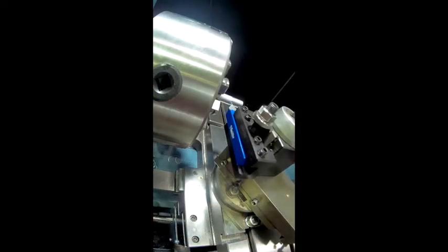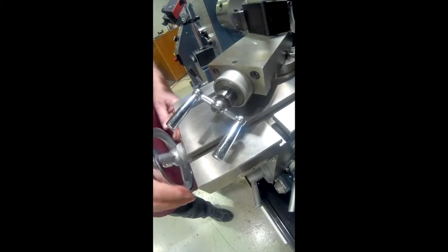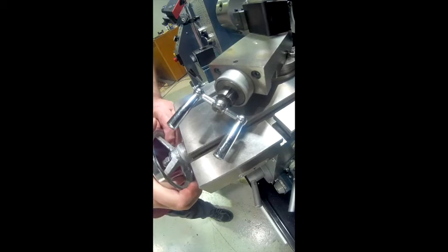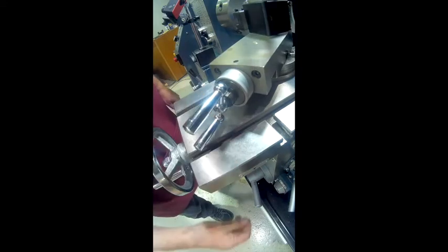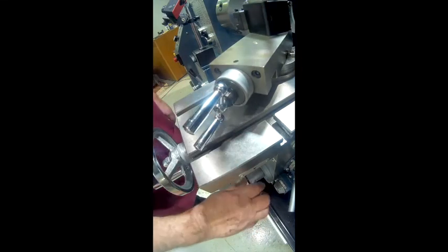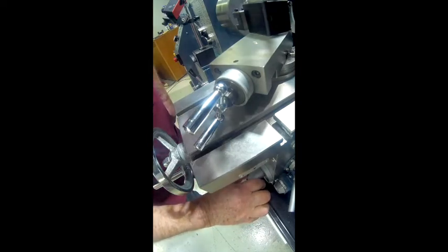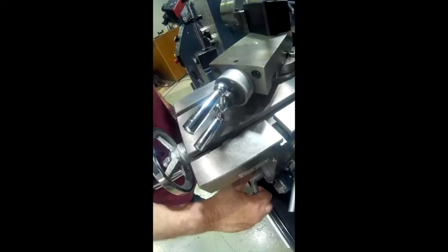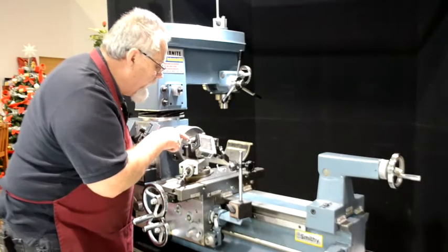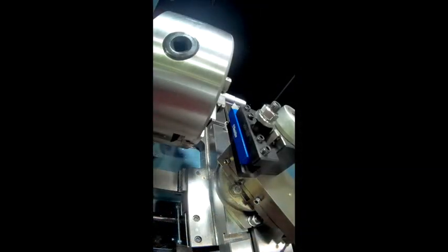Back up and go back to the beginning. Now we can make a deeper cut than what we've been doing here — I'm just showing you this to demonstrate the techniques. We'll take a much deeper cut this time. Turn it on again, wait for our threading dial to come around, and there it is. Watch the cut, get up here and turn it off. Each consecutive pass makes that thread just a little bit deeper. That looks like our last pass on this.